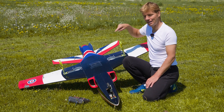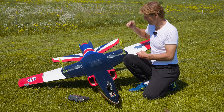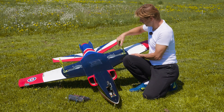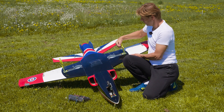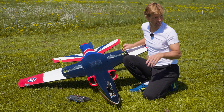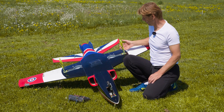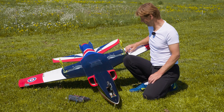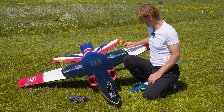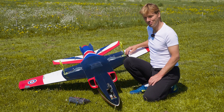So I saved 100 grams on both of them, which is great. But the main idea was to increase the travel of the arm so that on a bumpy runway like we have here, the leg will be working instead of bending the connecting pin between the mechanics and the landing gear, because I had constant problems with that.